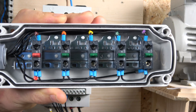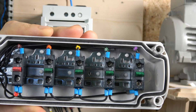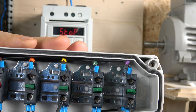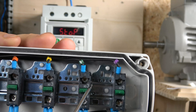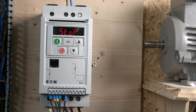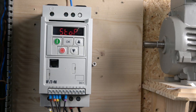When it comes to wiring, we have the normally closed contact where the 24 volt signal comes through and then sends power to all the normally open contacts. Our first contact is the forward run signal going to terminal 2. Then bit zero goes to terminal 3, bit one goes to terminal 4, and the max speed per program goes to terminal 6. The max speed is actually determined by your max speed in parameter P01.